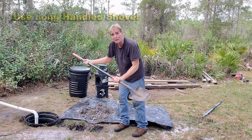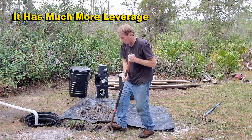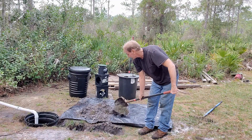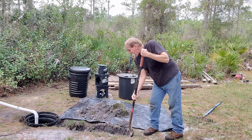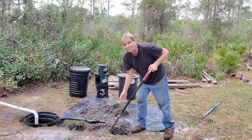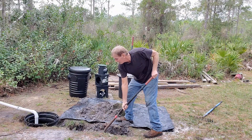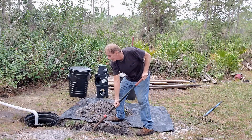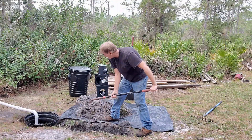Go back to a good sharp shovel. These are Razorbacks — that's my favorite shovel, and I get them at Home Depot. We're just going to dig a little trench here. Remember to dig backwards — it's very important. After you dig down your first pass, come back and push that shovel with your body weight to clean it out, and it's going to be at the perfect depth for almost every drain line. Use your body weight, push it forwards, and lift that dirt right out.